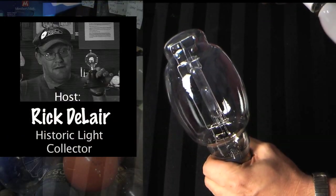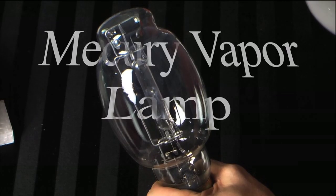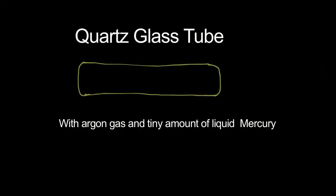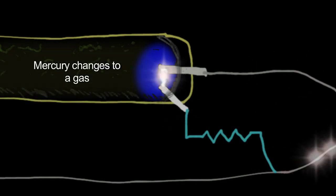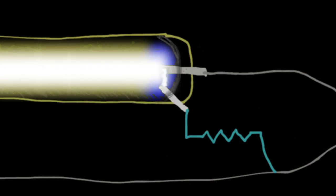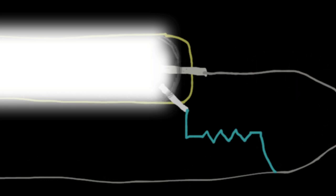What we have here is one of my favorite light sources — a mercury vapor lamp. The operating principle is the same as the metal halide: the current passes through the gas in the tube, the argon gas, and heats up the mercury until it vaporizes. The mercury vaporizes into the arc stream and the intensity of the arc increases as the lamp warms up. The arc produces light by itself, so it doesn't need a phosphor coating to produce usable light.